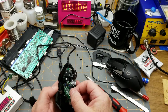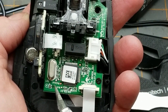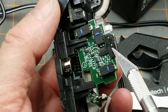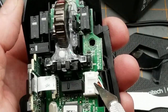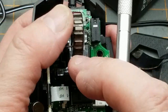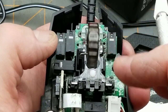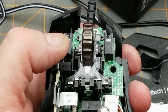Hopefully I can get this thing back together again. There's a lot going on in here. The LED window comes up through a little light pipe from an LED down below - looks like a tri-color LED. There's a little daughter board on the side with more LEDs and three switches. That's probably going out to the USB. There's a mouse wheel, and this little button on top can make that either a clicky scroll or a free-rolling one - interesting.